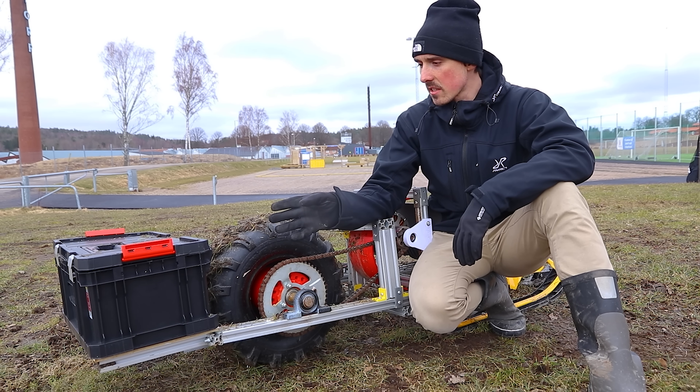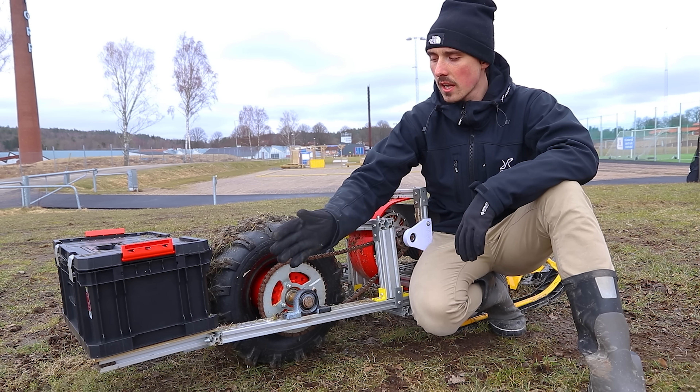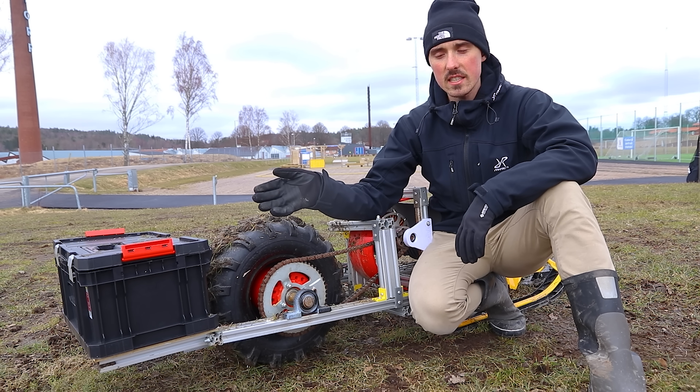The second thing I've done is adding a massive box in the back to hold the batteries, instead of the wooden containers where the batteries were standing up, causing a high center of gravity — which is most likely why I tipped over.